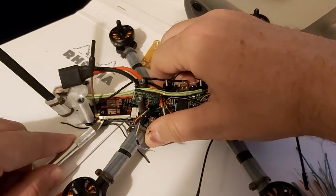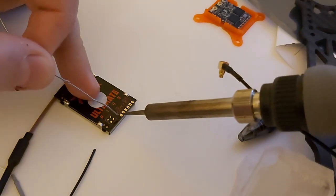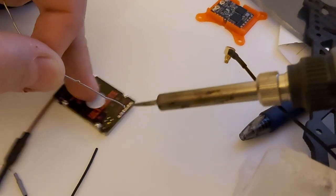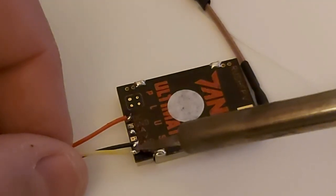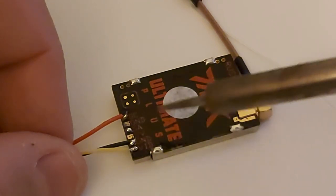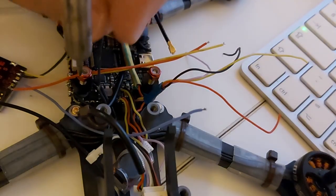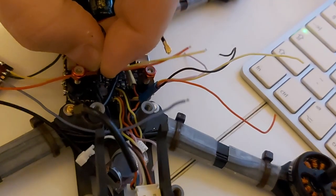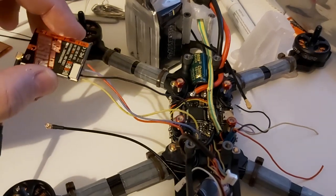Back to square one for the VTX at least. I got the receiver and it came with wires long enough to make a direct connection to the VTX — I'm going to unsolder the old connection. Never use double-sided tape before you've tested everything — that was a bad idea because it's really hard to remove. I'll tin the pads and solder the wires directly, which will be better than a connector. After testing it just like this — no flickering! So the question is whether it will flicker once everything is back inside the quad.